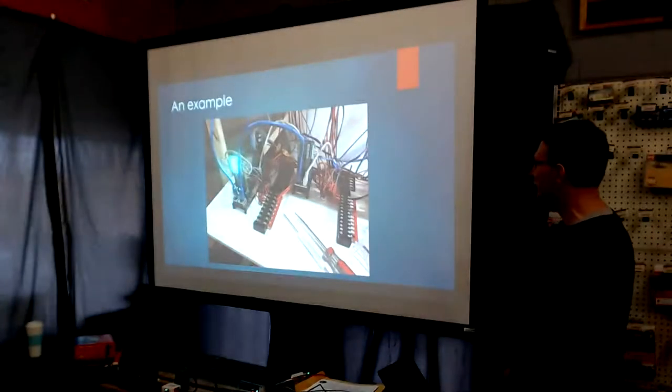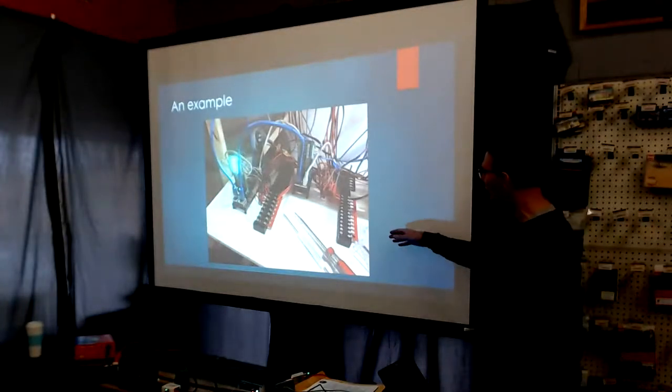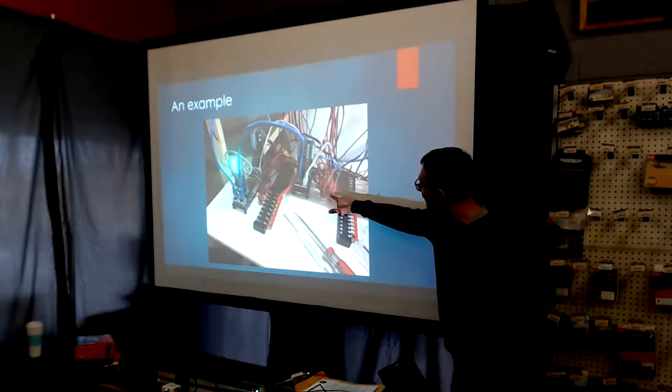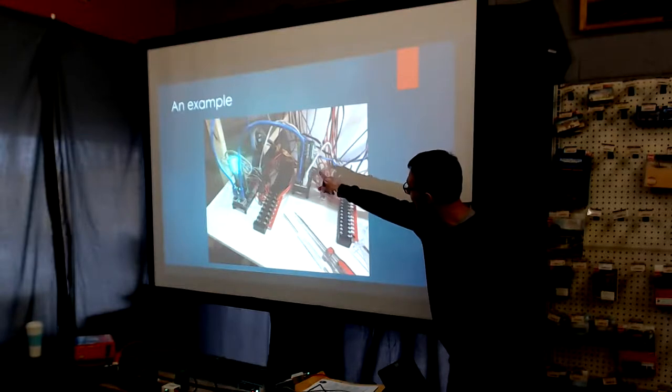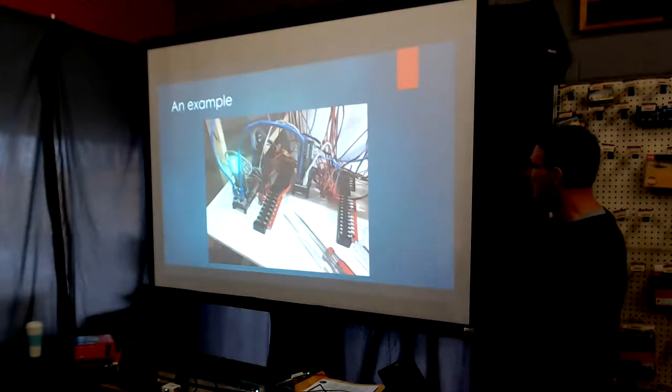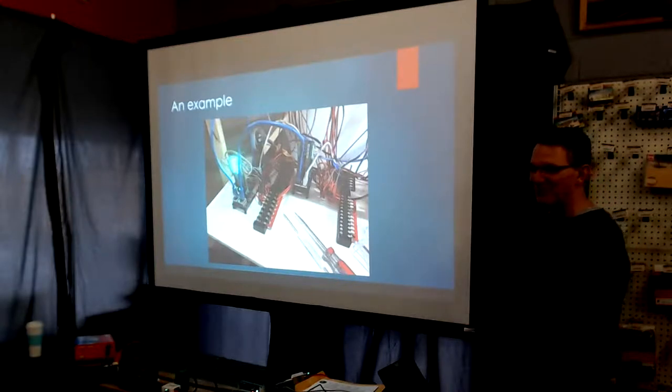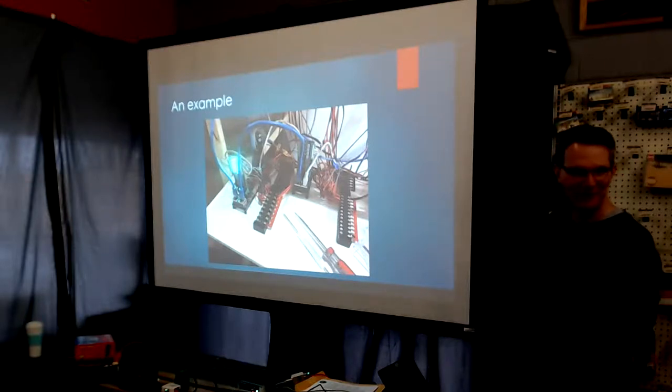This is what it looks like after I got it a lot wired out. So here's my bus for the DCC, all the different leads going out to my staging yard. And you see the CTs? And then I just ran jumpers over into the I/O cards. And you know, you just put on the music and get your iced tea going, wire strippers and soldering iron, you start just cranking away with it.